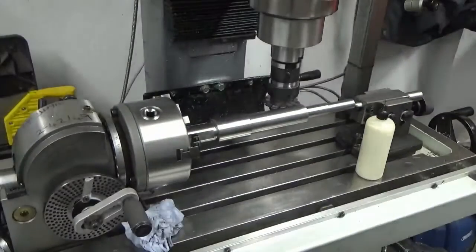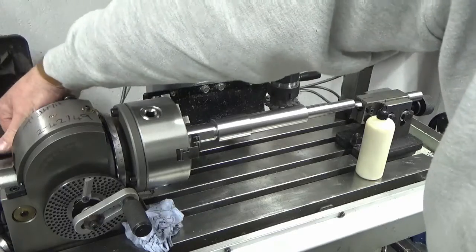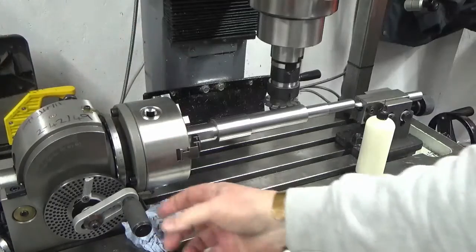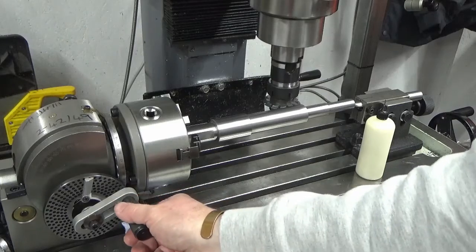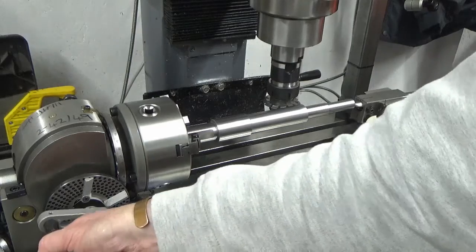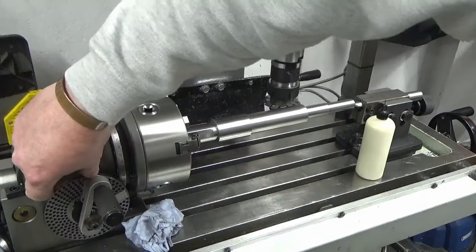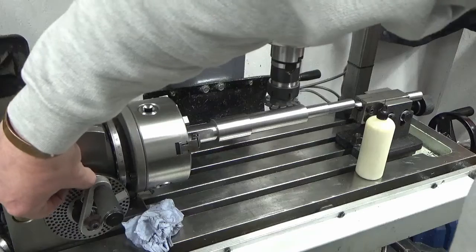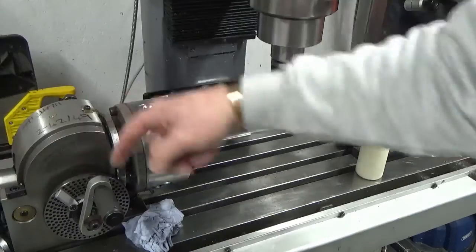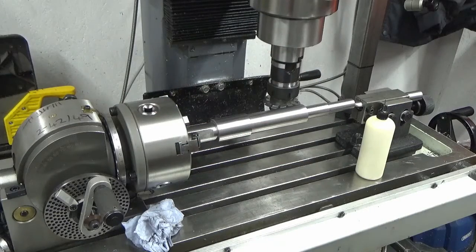So we've got it all set up. Basically between each division, it's a bit bizarre when you're used to working between the sector arms the other way. So basically I'm set up there now. I'll come out of that, I'll do my 2 full turns, so all the way around once, all the way around twice, and then when I come in for my 42 holes I then drop into that inside sector arm and then wind the sector arms counterclockwise until this sector arm touches the pin, and then my next index will be 2 full turns, and then I'll drop into this hole. And that's the way the book tells you to do it, so that's the way we're going to do it.